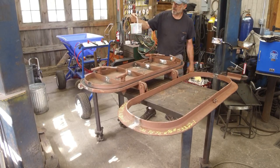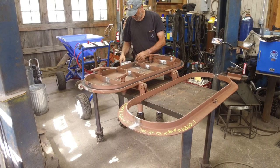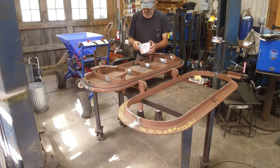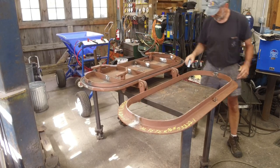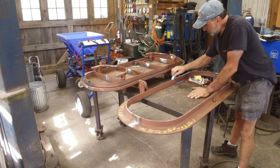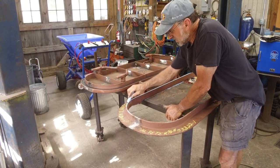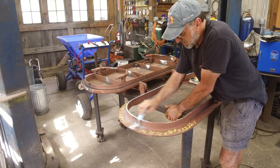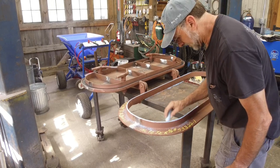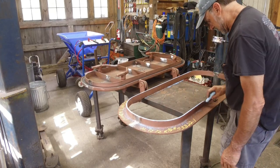Okay, next, we get out our jumbo sidewalk chalk. We got 20 pieces in here. And we pick out a color. We could use white, but let's use the cool blue. Now what we're doing is we're just smearing some chalk on this knife edge here, and we're doing a transfer like you would do, like bluing metal to metal contact areas. If you have a holiday in your chalk, you can have a holiday on your mark.